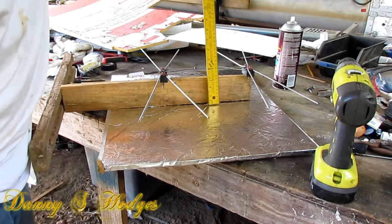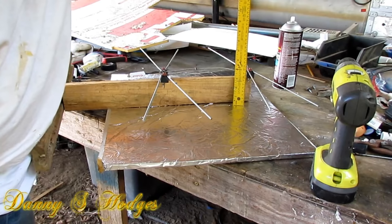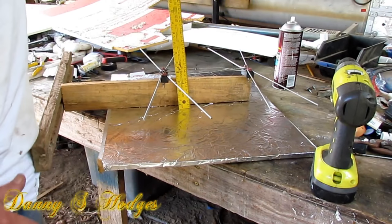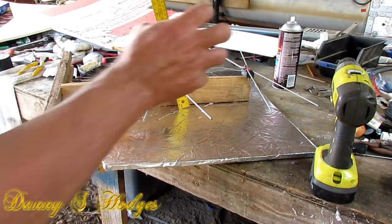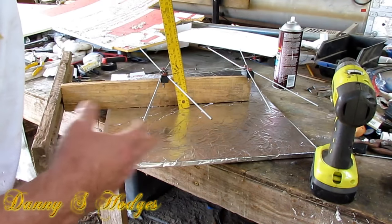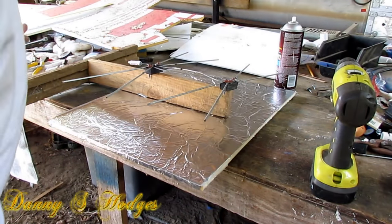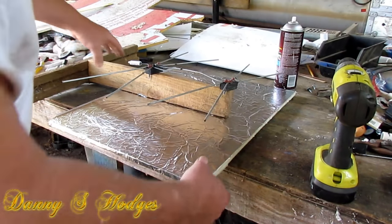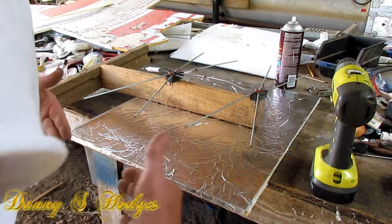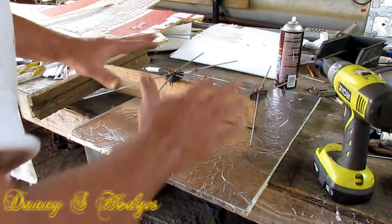Let me measure this and see. Hey boy, that's the perfect amount — we got lucky. In between about three and three-quarters and four inches. Y'all, I've tested this stuff. I got a little screen that I made that I could slide back and forth, and I spent hours and hours moving that thing in and moving it out. That's the reason I know what the perfect measurement is. And even as many antennas as I've made, I always make sure that it's good all the way around.